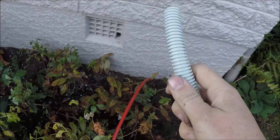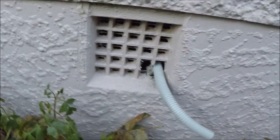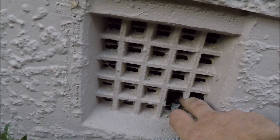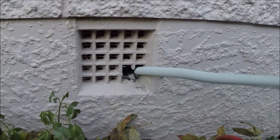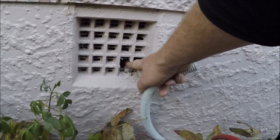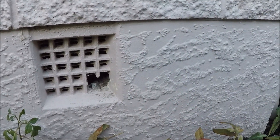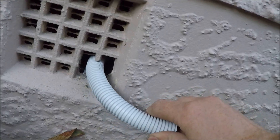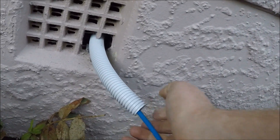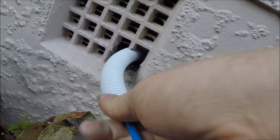A piece of 20mm flex — I'm going to stick that through the hole there. As you can see I've crumbled that because I wasn't watching what I was doing. So I'm just going to use 25mm flex now. I'm going to fill this hole in, probably put a bit of cement over it, and now we're going to run the draw cable straight through that, then get under the house and sort it out.